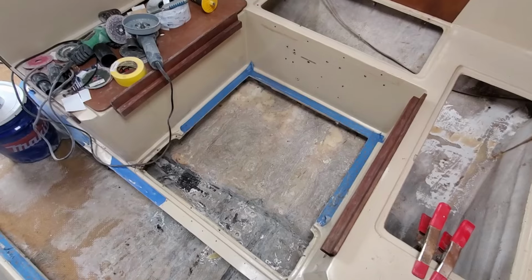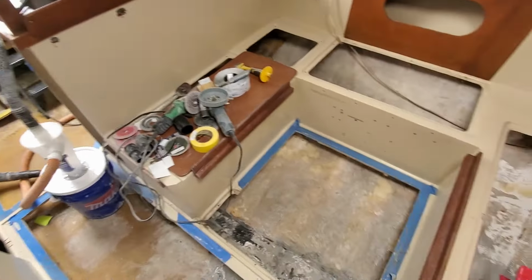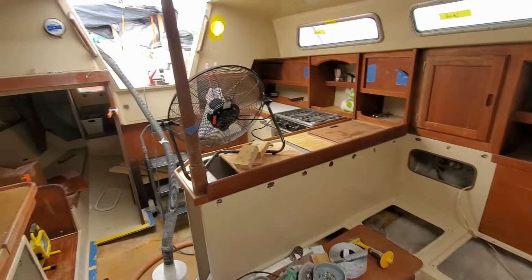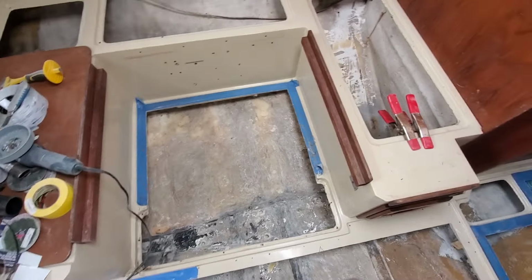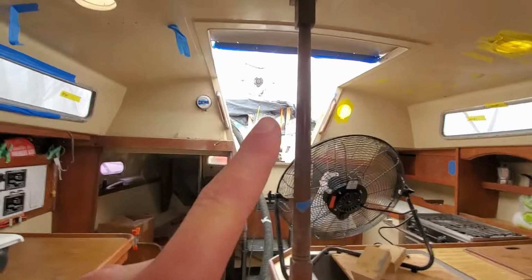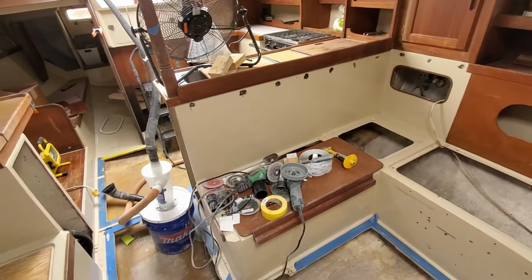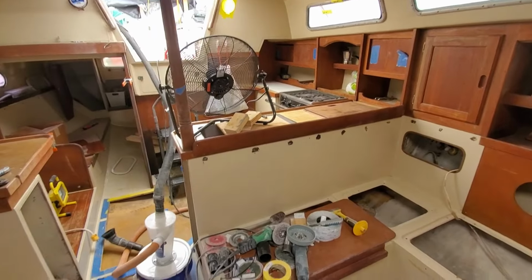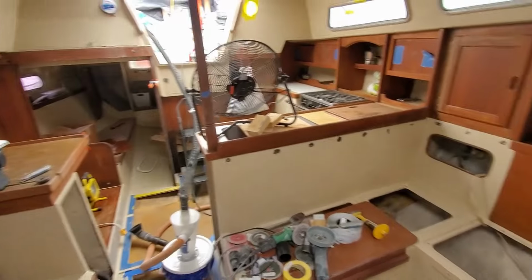So for the last few days, Christoph has been grinding a lot. All right, that is what it looks like after a day of grinding. That was basically yesterday. I didn't have these fans, so I attempted to just close it off and fully go at it, which is not a good idea. You need fresh airflow constantly. So I bought one, two, and three of those fans, and now I just compressor blasted everything and it goes right out. And we try to catch as much as we can with the cyclone bucket and then the vacuum outside.